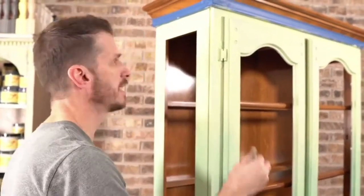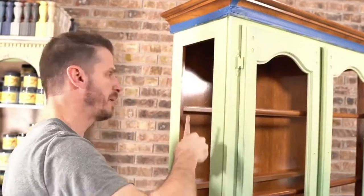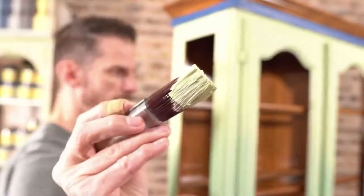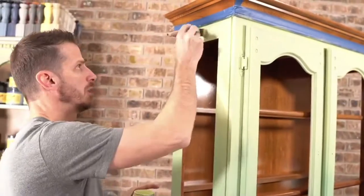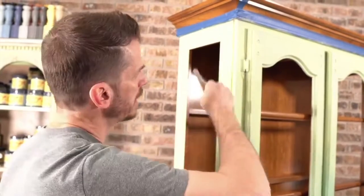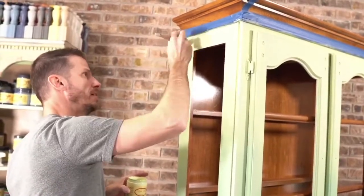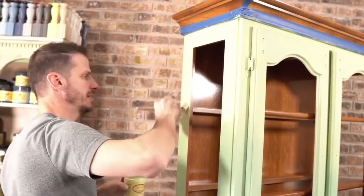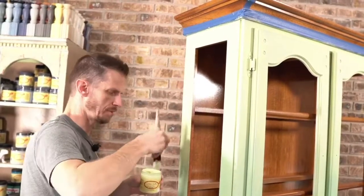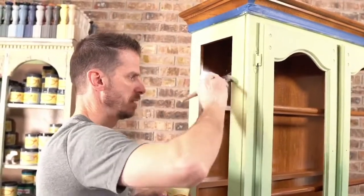The great thing about painting with chalk paint is that the second coat always looks the best, because the first one's a little thinner — you don't want to paint too thick with chalk paint. Just a little bit of paint on the brush; try not to get the paint too far up, keep it further down. If you feel like your paint is sticking or dragging, you might need to mist. A new container of paint is always best; as an older container sits, moisture evaporates and you'll need more misting.